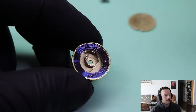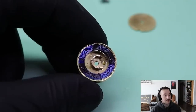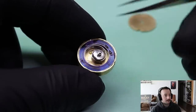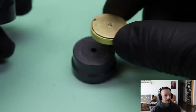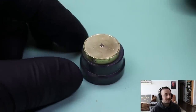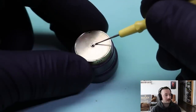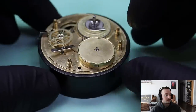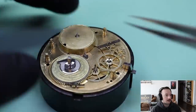I went a little heavy on the oil because it's very old and worn and it most likely needs it. As you can see, the inside of the mainspring barrel is quite worn, meaning there's a lot of friction. Some D5 in the middle as well. Another handmade mainspring barrel closer tool. A little bit of D5 for the click for the fusee.